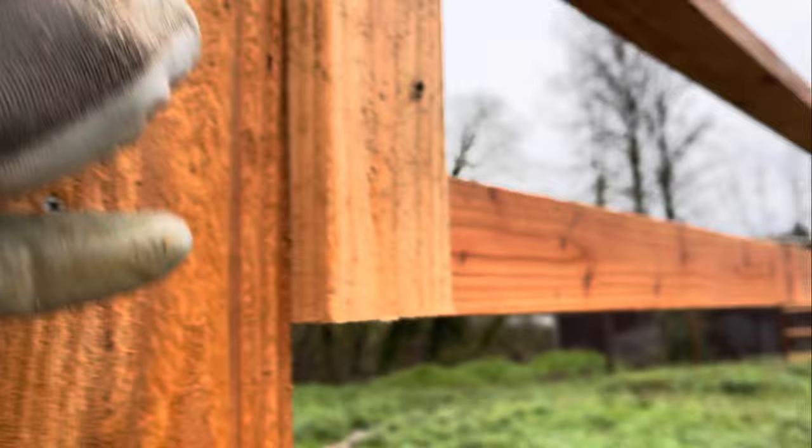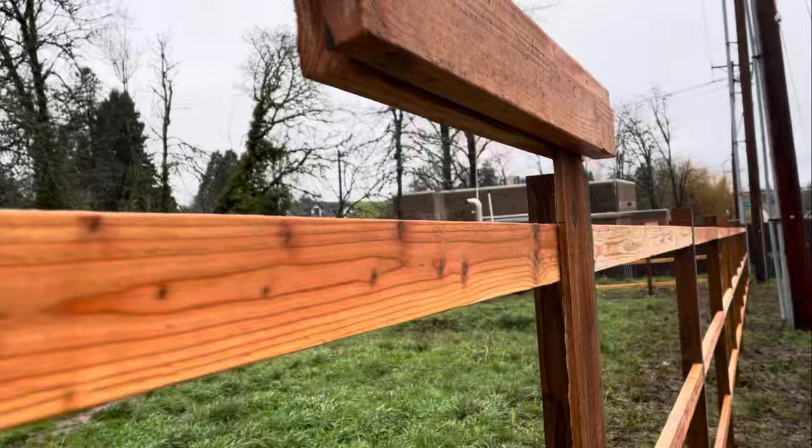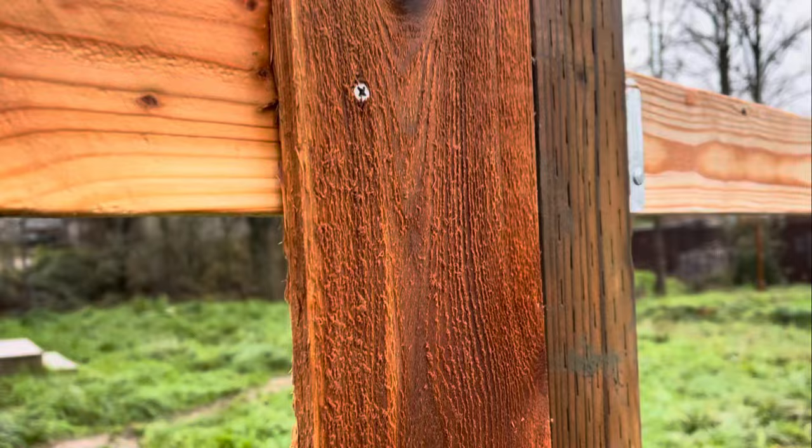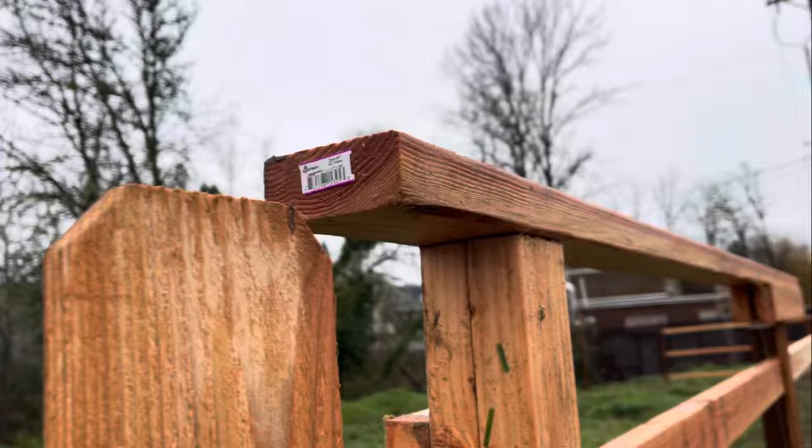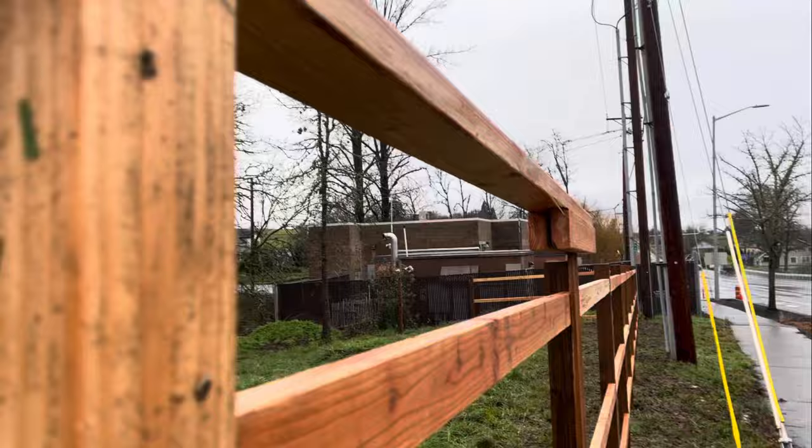I made this jig. I've got this board marked at eight inches and this is going to be where I slide the boards up. This one's at eight inches. So as long as I start with the board, this just sits right on top. And it's channeled in. This one is boxed in on both sides of the 2x4. So you can see that this is there on eight inches — that automatically becomes my gauge for the height of my board.